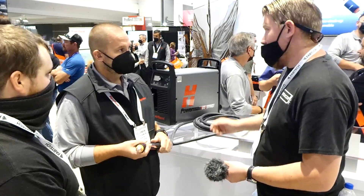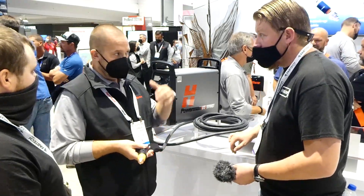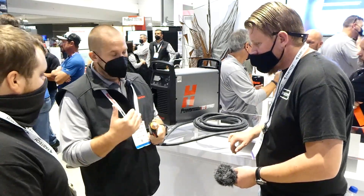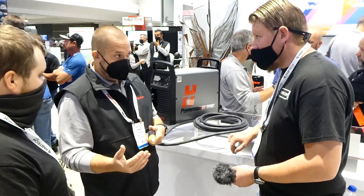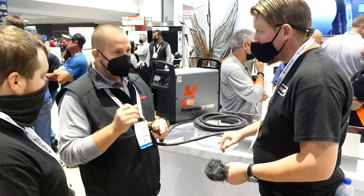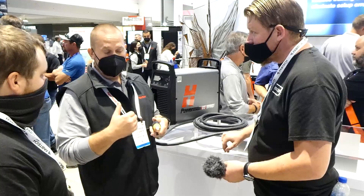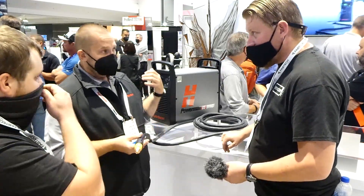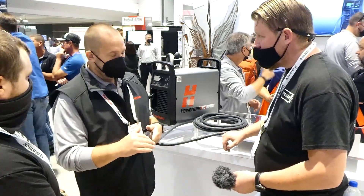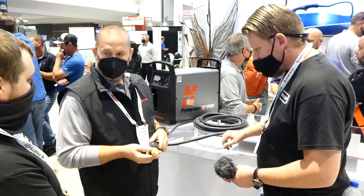It's almost a one-through. All three of the new machines have that end-of-life detecting feature. What that's doing is looking for arc voltage fluctuation occurring when the electrode is nearing the end of its useful life. There is actually an arc voltage spike that occurs very late in the electrode life — if you run the torch to that spike, you can damage your torch and the workpiece. The end-of-life feature prevents that. But most customers are going to change it well before that because of their cut quality — that's the single biggest indicator for people when they change their consumables.